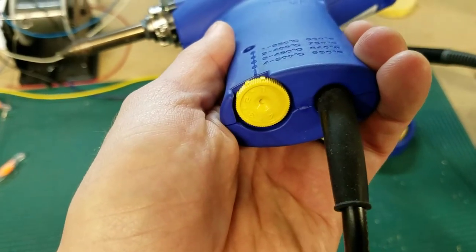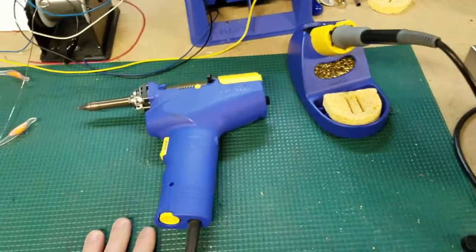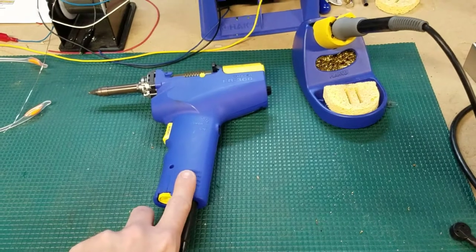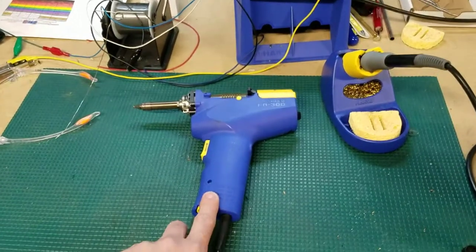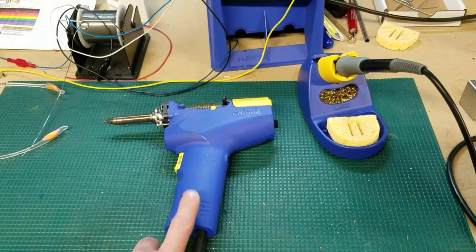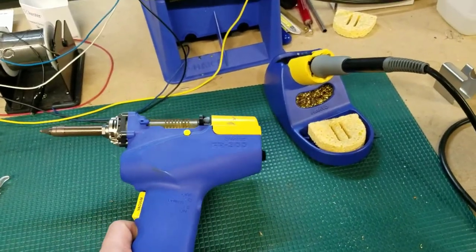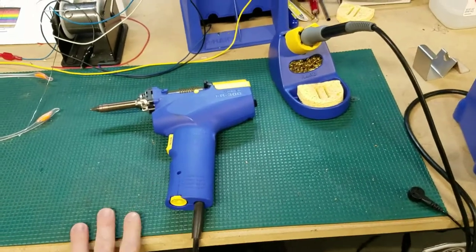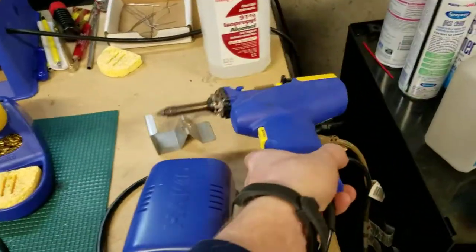You have to be a little careful with the FR-300 — not only does the tip size matter in terms of what you're doing, but also the amount of heat it can generate. I actually keep mine pretty low, around 1 to 1.25 — that's plenty of heat to do almost anything you want. It's a great tool if you're doing any NVRAM replacement or getting into board repair by changing headers. Of all the money I've spent on tools, this has been one of the nicest things I have.